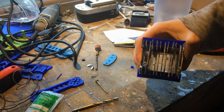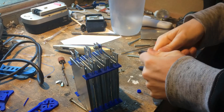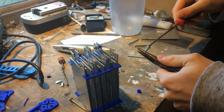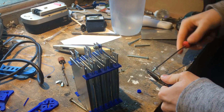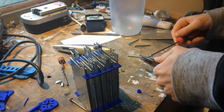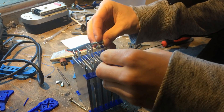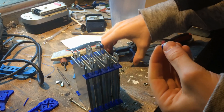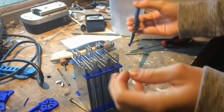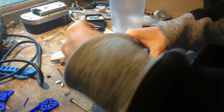There you can see the first two cells being connected together, and then exactly the same procedure is done for the rest of the cells. The M4 bolts I used were a bit long so I had to cut them down. A really good method for cutting M4 bolts down is to put the nut on first, then cut it, and when you remove the nut it re-taps the threads so you can screw it in properly and the end thread won't get mashed. When you cut them without the nut on they are really hard to get back into a nut because the end of the thread is a bit bent.